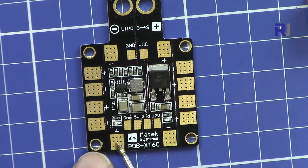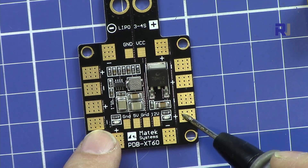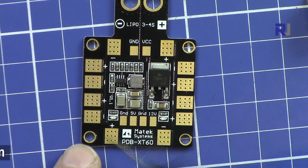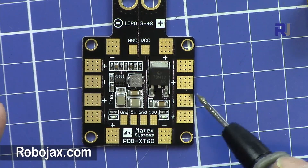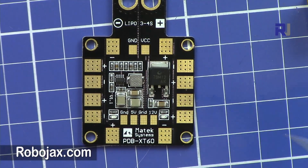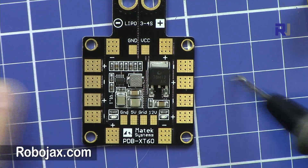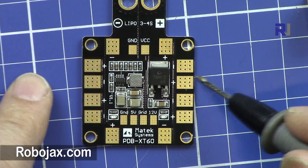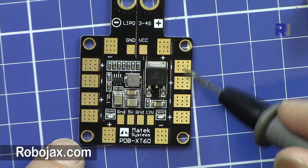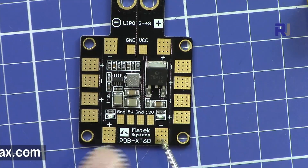These two you can connect to your battery. Actually anywhere that you see here, plus minus and plus minus — all the plus terminals are all common, connected to each other, and any minus terminals are all common connected to each other, except internally here. So to connect your ESCs, you can connect two here, two here — six ESCs for a hexacopter with six ESCs, or four ESCs. These two will be one, two, and then three, four, five, six. You can also put the battery connection here.